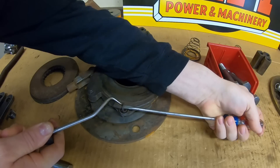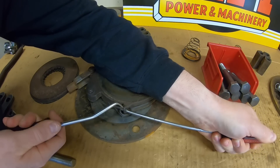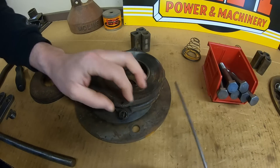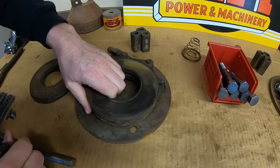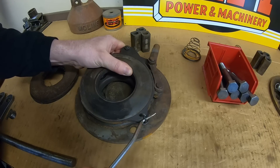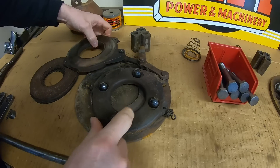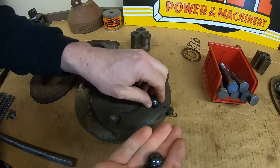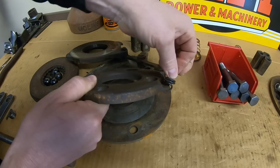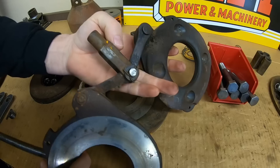Just able to lift that one a little. We'll put our universal prying device under it. Should be able to roll it off — the first one's always the toughest. The second one gets a lot easier because now we can hinge that plate up, get some of the pressure off of it, and pretty much roll it right off the side. We can then hinge these apart. We have four large ball bearings on the inside, all 7/8 inch diameter, just like the production tractors.